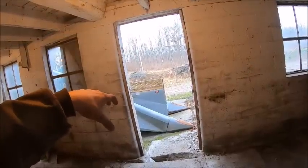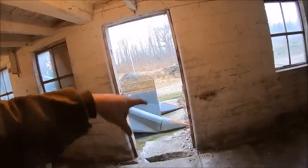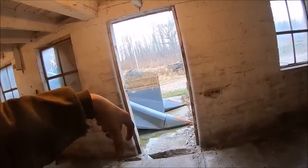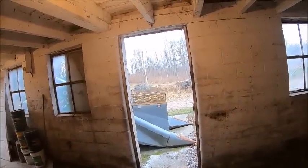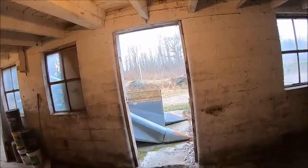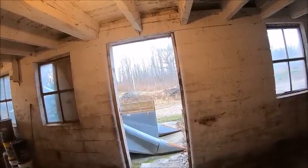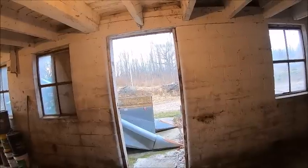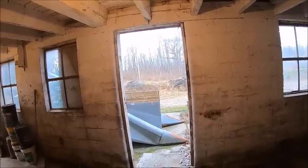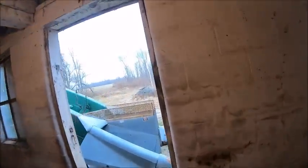I think I took four or five rows of block off the top, and then relaid two layers of block, put a chimney cap on it, and replaced that liner. But God, I don't know how people restore brick houses, because I tuck pointed that chimney, and that was enough. That was enough of that for me. I couldn't imagine having to do a whole damn house. But anyway, since I got that, that works really good for taking the mortar out.